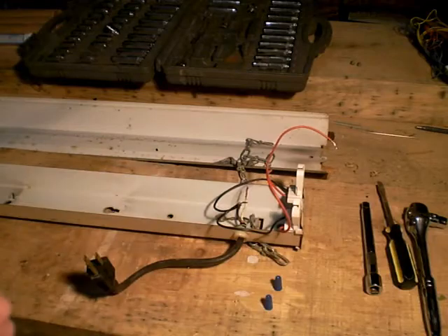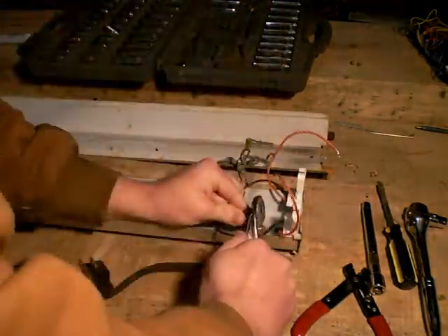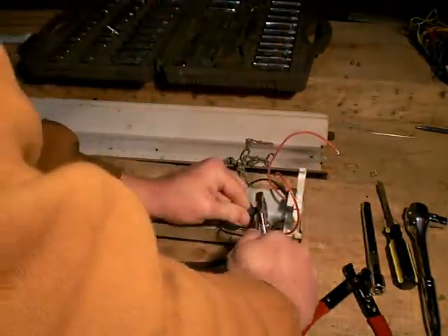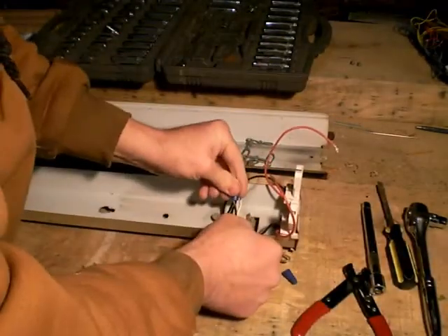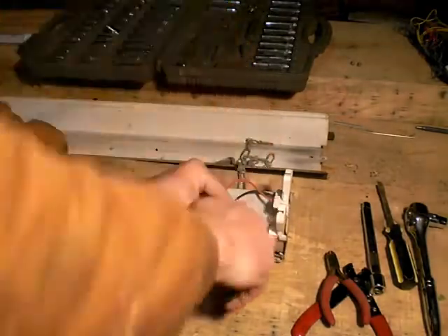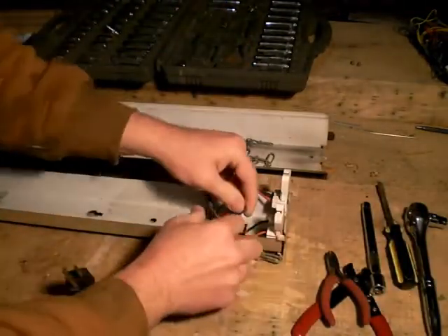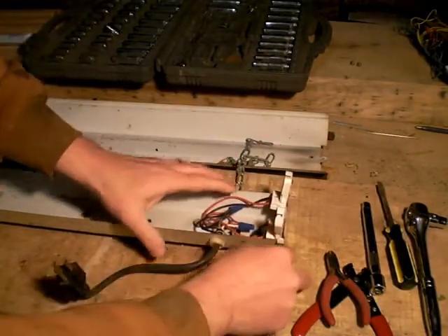I may need to trim some things first. Let's go ahead and torque that on there as tight as we can make it. I definitely don't like the thought of wire nuts coming loose, so let's pull on it real good. Okay, that's not going anywhere. Let's do the same with the white — pull on it real good. It's not going anywhere. Excellent.